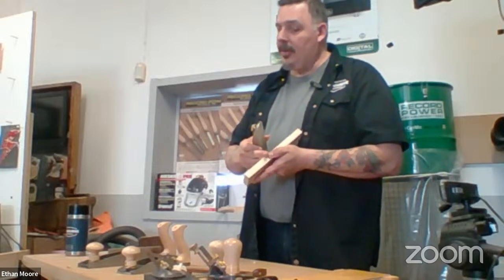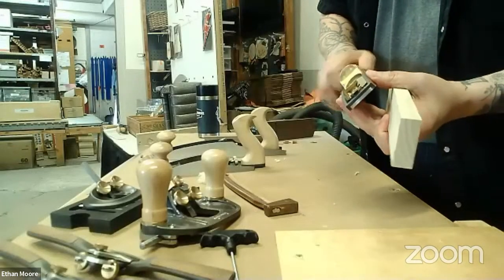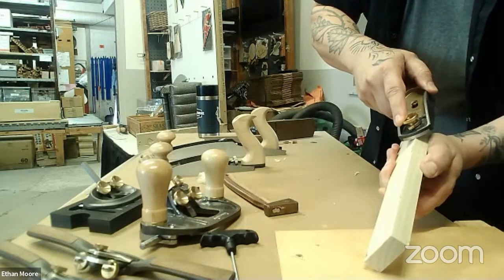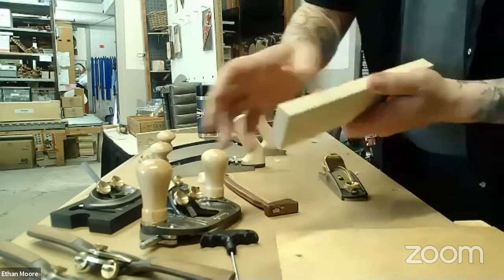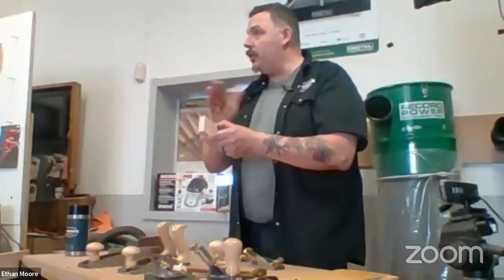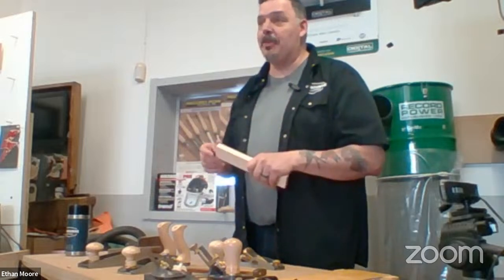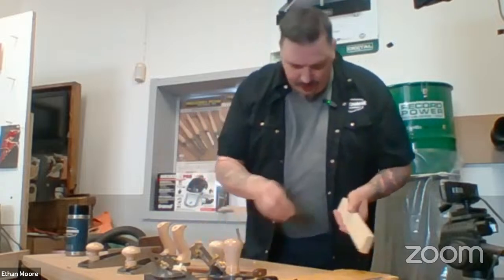With a block plane, I can do a round-over in five passes. I do three at 45 degrees — one, two, three — and then one at roughly 22 and a half degrees each side. Now I've got a little bit of a round-over, but not enough that you've made it doughy-looking. If you're using maple and you leave the material as milled, you will cut yourself on it — I promise. It's equivalent to a cardboard cut, and those smart. Being able to quickly knock off the corners is a big deal. Oftentimes I'm using this plane one-handed just to take some of the corners off.